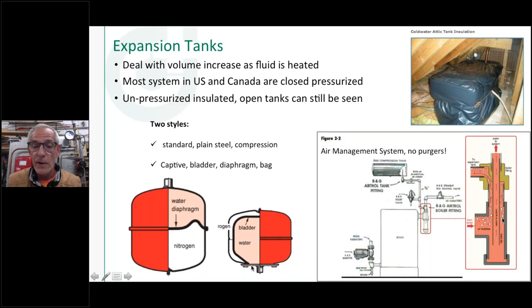That's how they load it in there. And it can also be replaced. You don't typically see these in small tanks, although you can buy a small residential size number 30, number 60 with this type of a bladder in it. But it's usually the larger tanks, more of a commercial, maybe even an ASME tank that you'll see is this type. Unique about this, it's a full acceptance tank.